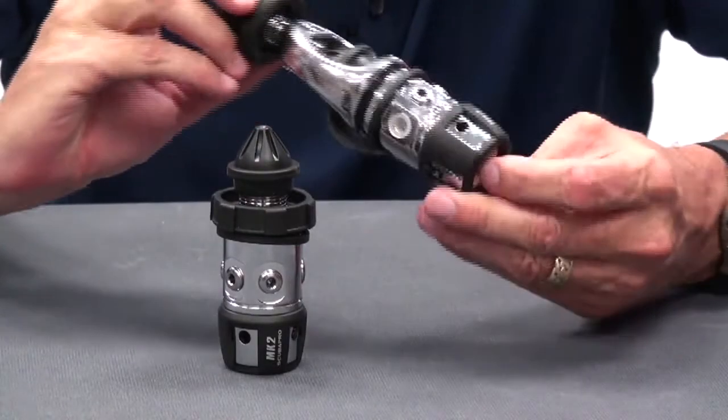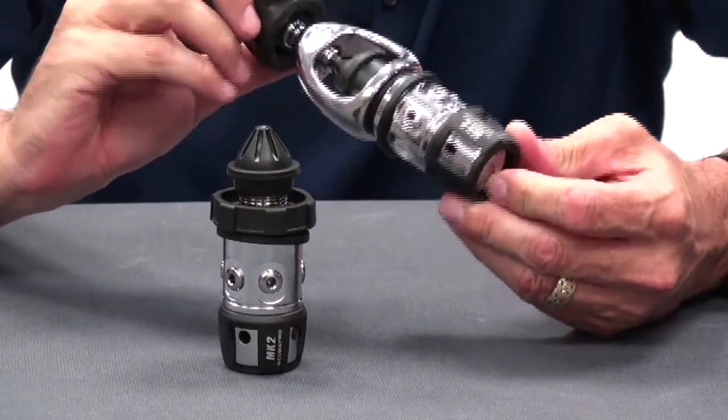Made of marine brass, chrome plated, it's very robust and has one moving part. It's what we call a classic downstream piston. Downstream simply identifies that the piston opens in the same direction as the flow of the high pressure air.